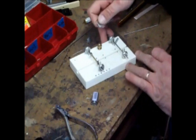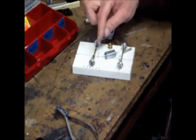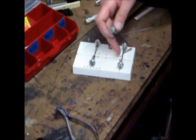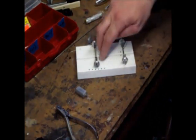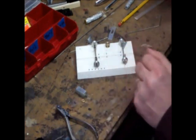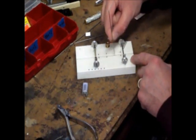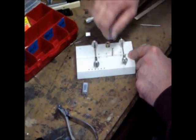Right now we've inserted some pins in our chassis jig. Since this car is going to use an FF050 motor, we basically want a half inch of clearance on the inside of the two chassis rails. These pins help locate those rails on the center line at the width we need. They're a little bit shorter than the sixteenth inch pins used on the front axles, so that they're not quite as much in your way. Now we need to actually tie those down, so we're going to take this little nut and slide it down inside this rail, then take this eighth inch threaded post and screw that in there.